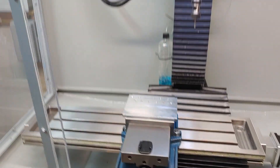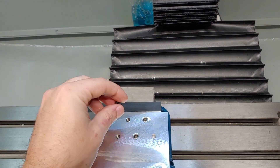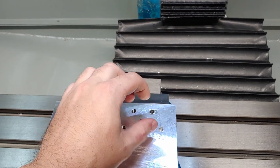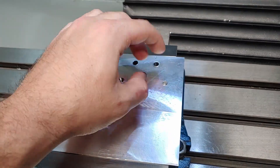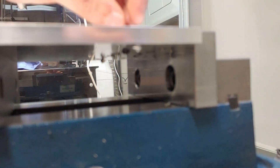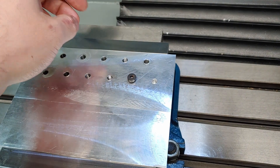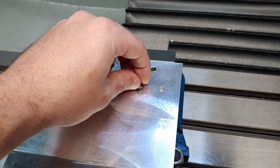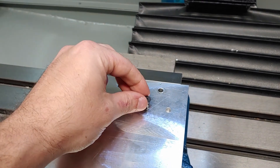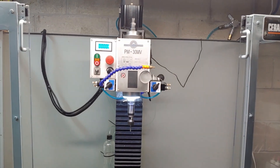So that is a quarter-28 inch — I just did this hole — and you can see that goes in nice and will go all the way through the bottom. Even though there is quite a bit of a burr down there, I haven't gone through and de-burred the backside of this yet, obviously.